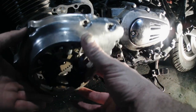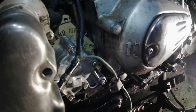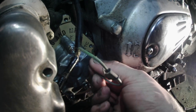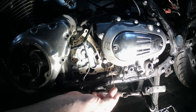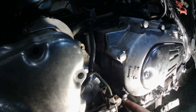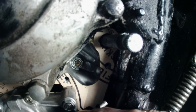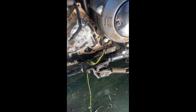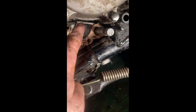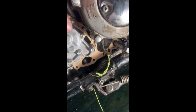I slide this together like something like that. I noticed something I didn't notice when I was taking this apart: there's a channel right there that I can slide my wire down to what I believe is my neutral light switch. Here's a little trick I learned back in the day building houses — I can snake my wire up and through. They say if there's no video, it didn't happen. I fished this copper wire through from there to there, pulled my string back, put a slip knot on the fitting, and fished it back through.